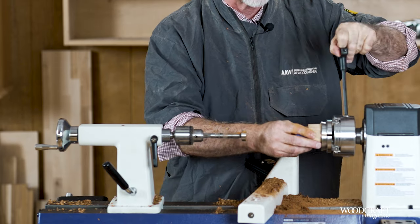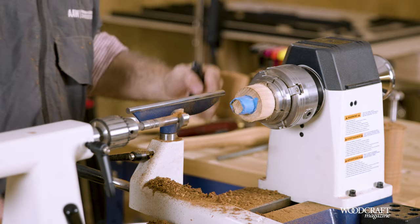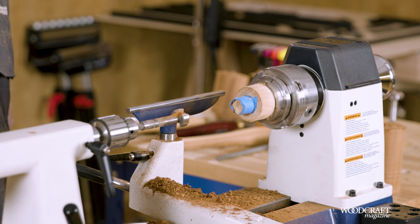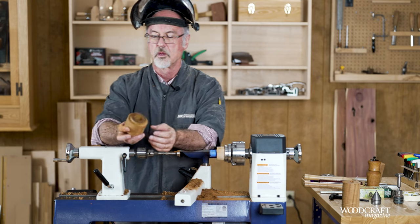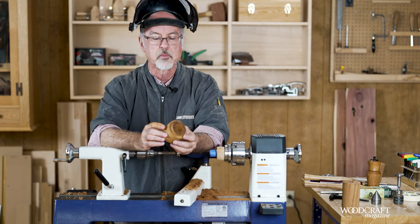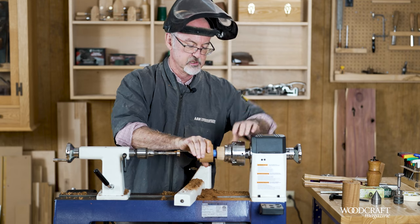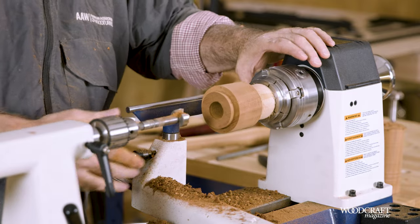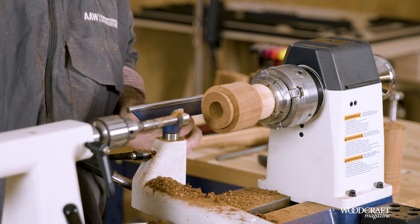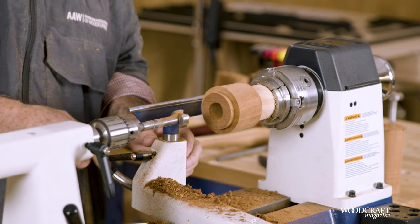I made this on a different lathe, so hopefully it still works with this particular chuck. And it seems to. We'll see if it spins true. Pretty close. So now, I want to turn this around and jam it on here, which is hence the name jam chuck. And actually, I think that tape may be just a hair too much, but let's just look and see if it spins true. So I must be living right this time.